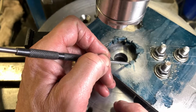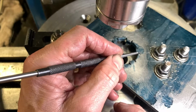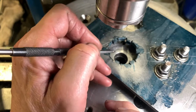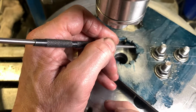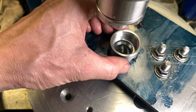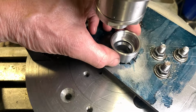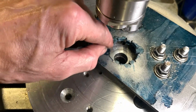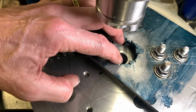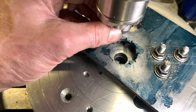We've gone round, we've worked our little 5/16 cutter into all little nooks and crannies, and I've gone round once and just put flats on these engaging faces. We are perilously close to that fitting, so I'm just going to go around. I've blued it up and just dust off probably the first 3 faces, see if my nut drops in, and then do the next 3 if not.